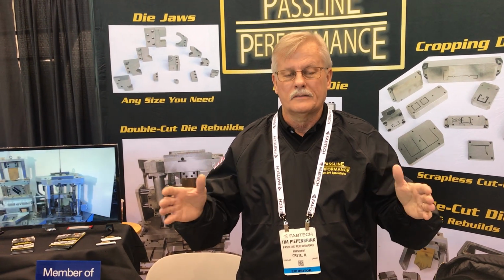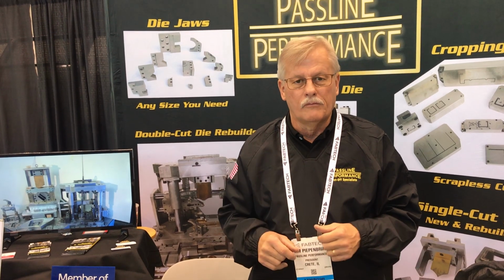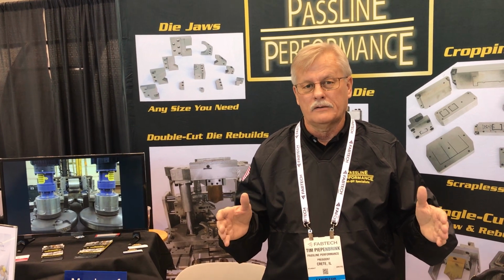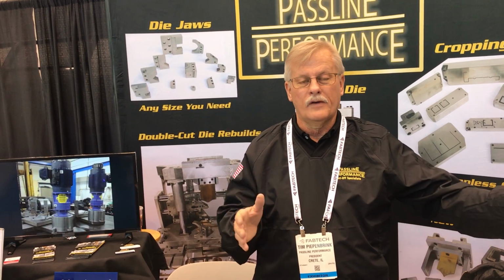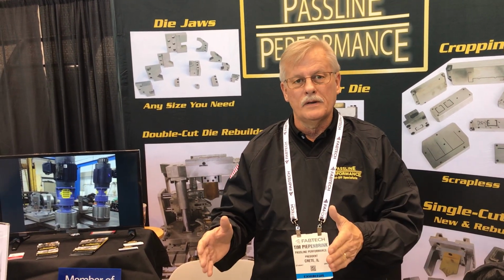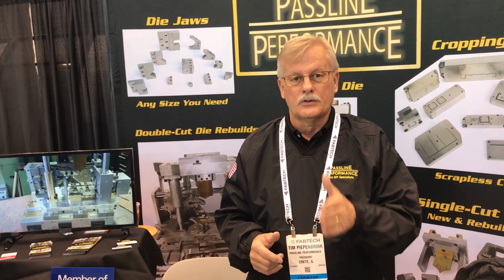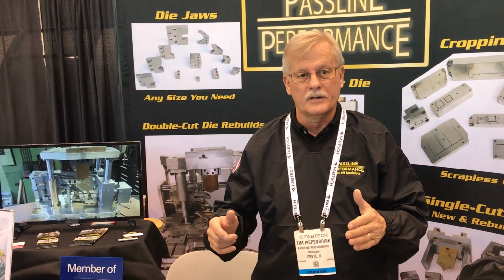Some of these guys are running 200-300 inches a minute of product, but for the smaller pieces and the high volume, low cost commodity items like conduit or corner edges for drywall, that stuff goes fast, and sometimes these products are running at 1,100-1,200 feet a minute. So the cutoff die, if you do the math, if you're cutting off 8-foot pieces and you're running 1,200 feet a minute, sometimes those cutoff dies actuate better than twice a second. So they got to go and cut, come back, go and cut, go back. So it really is a fast-moving process because they're going at such speed.